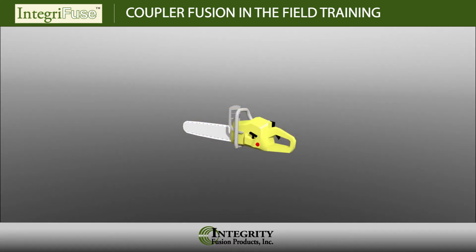Pipe cutting tools to be used for making a square cut on the pipe ends. For small pipe diameters, a blade-type pipe cutter or cutting saw can be used. For larger diameter pipes, a chainsaw can be used, making sure beforehand that it has absolutely no bar oil in it. Failure to cut the pipe ends square increases the chance of producing a short stab situation that can result in unwanted wire exposure and inadequate melt generation in the fusion zone.